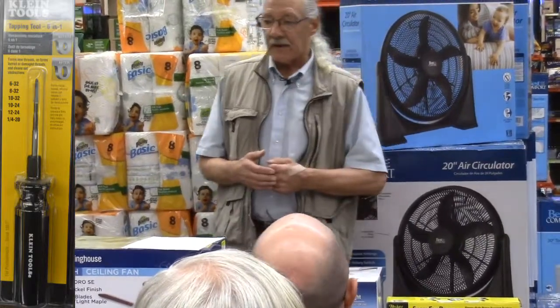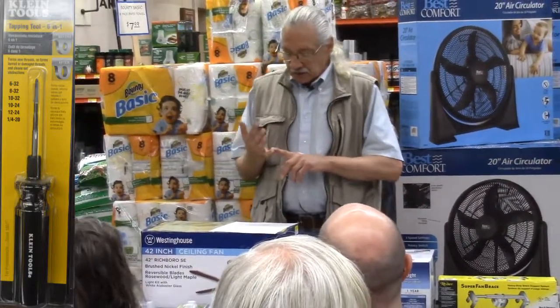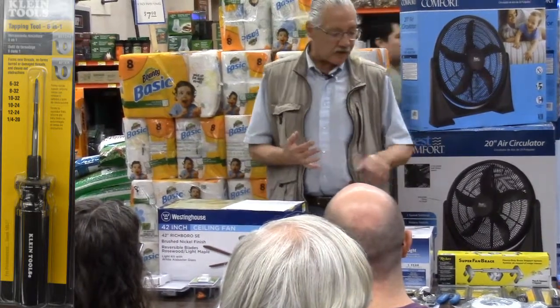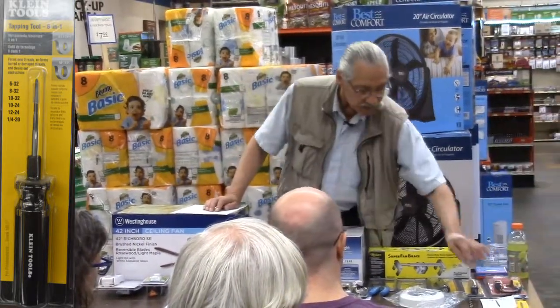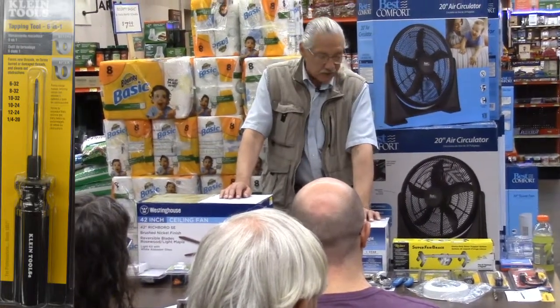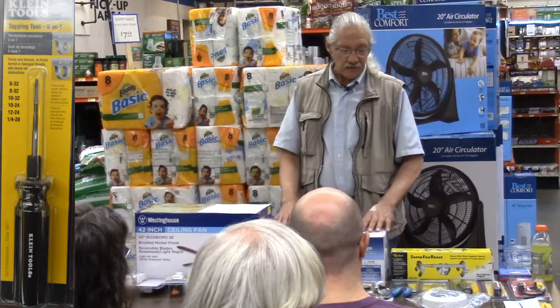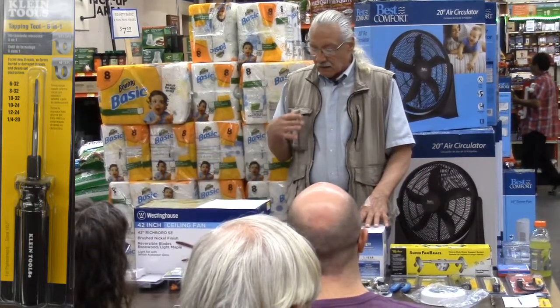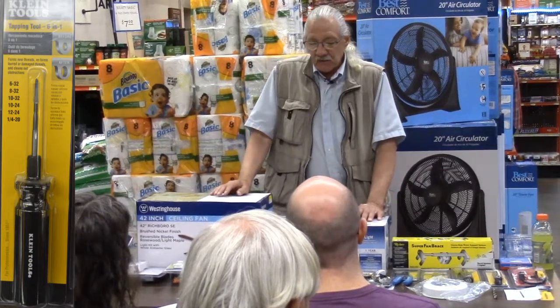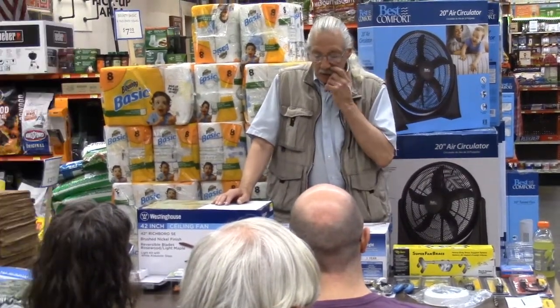Normally with a ceiling fan you'll be dealing with either a 10-32 thread or a 10-24 thread like this that come with most ceiling fans. They're slightly heavier than the standard box. Standard ceiling box takes an 8-32. There's nothing wrong with putting a ceiling fan on an older box.